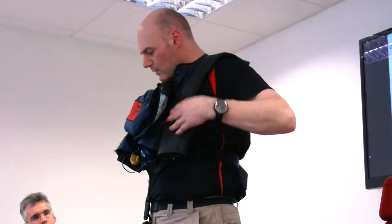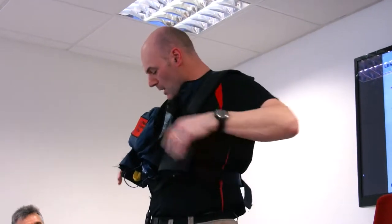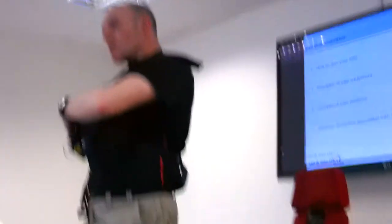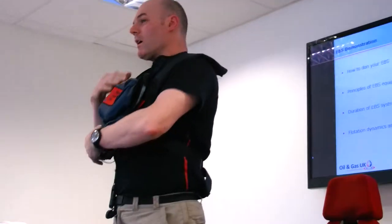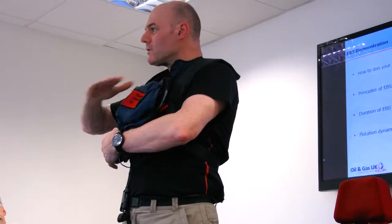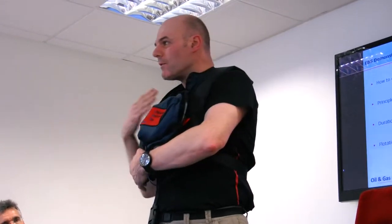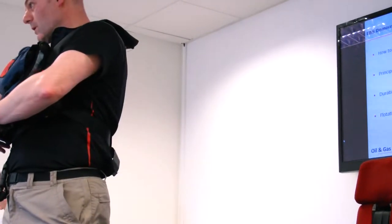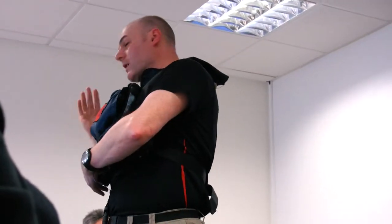The EBS itself — the breathing system. These are used where you have time. So in the event of a ditching, if you have prior warning and the helicopter comes into the water slowly submerging, you have time. Then you would deploy the system and activate it, ideally just above the water. So when you do end up underwater, you have the full breath benefit — the breath you put in, plus the charge inside the unit. It's there purely to control your breathing and give you time to push out your exits and make an escape.